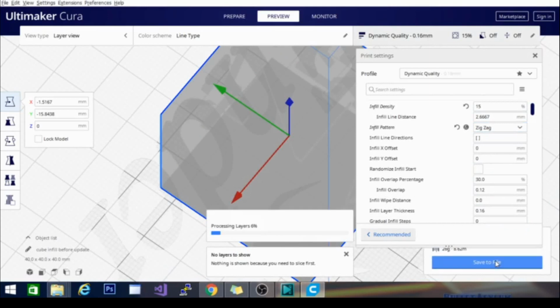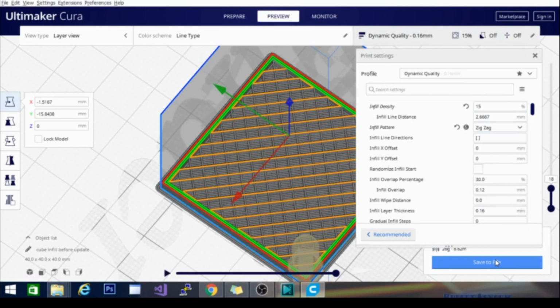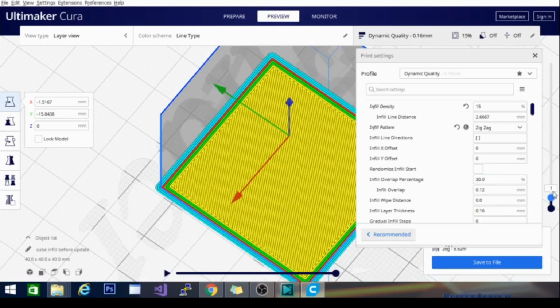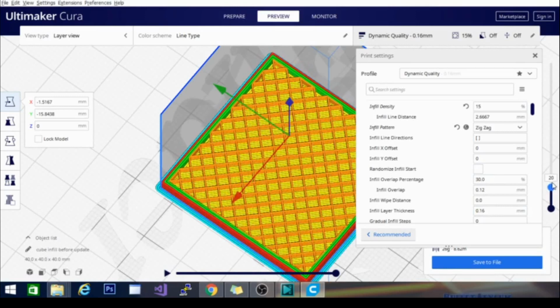My slicer is actually working pretty well today. This is 4.5, everything seems to slice pretty well. Now in the zigzag pattern, it's going to do somewhat like the cube pattern, except it's going to put down one way and then the other, and you can see in here it does travel against the wall and give you a little extra bracing there instead of just being straight lines all the way across. So that is pretty structurally sound.